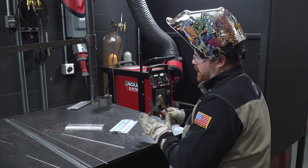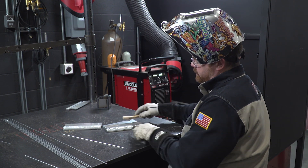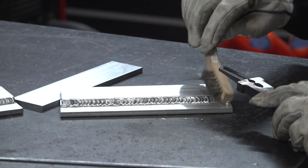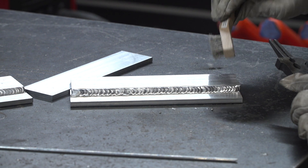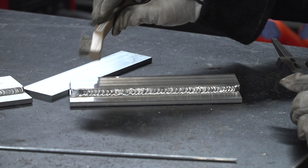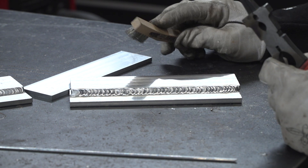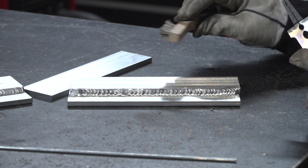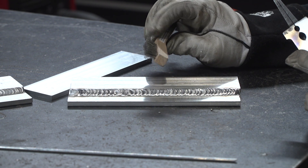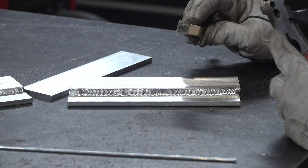As you can see, that AC wave etched the part we were welding — you can see that etching line all along that edge. The whole weld, the filler metal itself, is very clean. All the oxides are cleaned off by the etching action. I also had good penetration, and slightly a little bit more control simply because not all the heat was always going directly into the part.